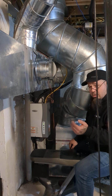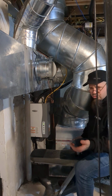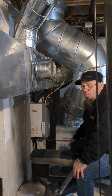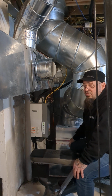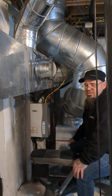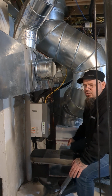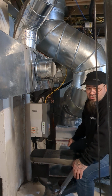And when you get into the lower end of that, the 20s and 30s, you can actually do damage to your structure. It's not structural damage where the building's going to fall down, but your trim can start to curl. Your wood floors can certainly, if you have a lot of wood floors, you definitely want to manage humidity in a home full of wood floors. It can really wreak havoc having super low humidity on the wooden parts of the house as far as curling and just damaging the way that primarily they look. Typically dryness is not going to do enough damage to harm the building, but it will make some things that were beautiful ugly real quick.